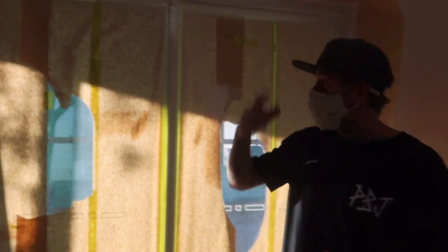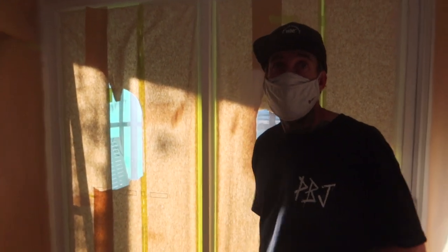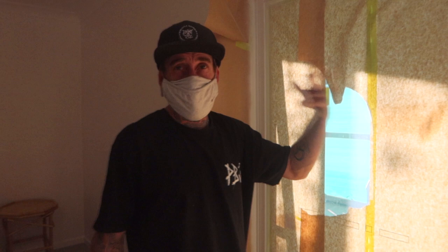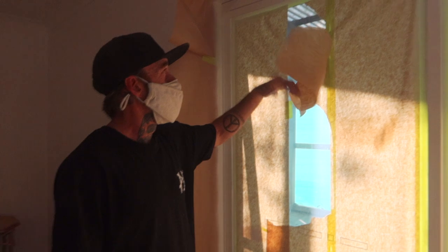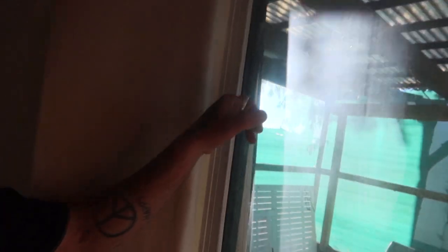That's how you do an aluminium sliding door. So that's from preparation to our primer coat to our two top coats over the top of that. Now we'll leave it about 5 minutes and we'll go through. I am very impatient, so I'll probably just start taking it down now, being very careful. But as you can see, keeping it off that 1 mil, you get a nice, beautiful, straight, thick line. And that way.